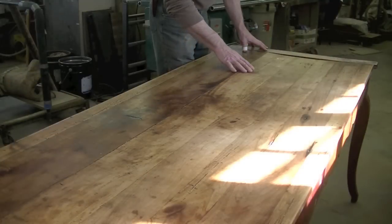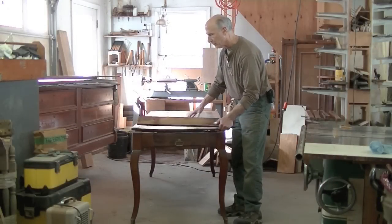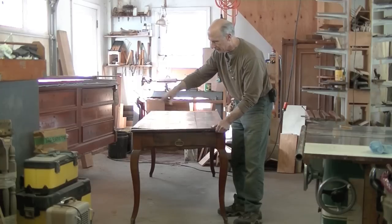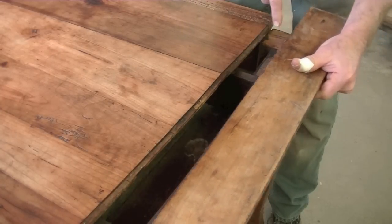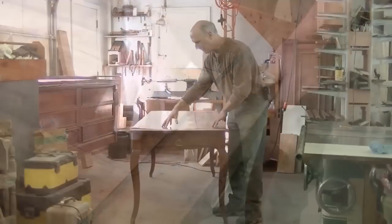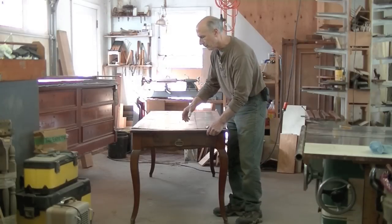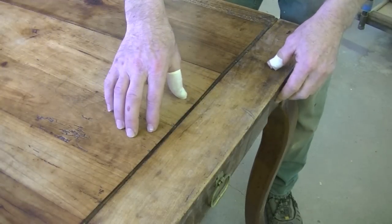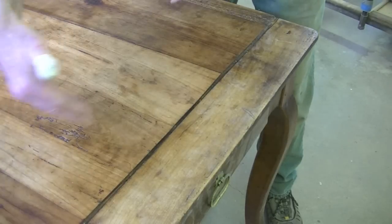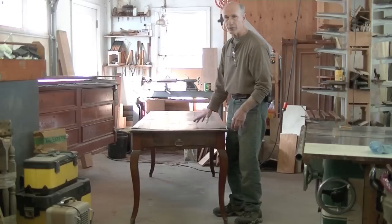The top is great — it's just completely worn down to natural wood, it has a great look to it. What's happened is a breadboard construction, which means the boards run lengthwise and these boards run perpendicular at the ends. When it was built originally, these two end boards were nailed down to the legs and they held these boards captive. But the tenons are so small — I don't understand why this tenon here is just tiny, tiny. So what I intend to do is cut new tenons, not the whole length of the boards. I'm going to cut three tenons — longer tenons — and I'm going to glue the center one and leave the end tenons loose so that the top can expand and contract, then reattach the top to the base as it was done originally. That should hold it and should work fine.